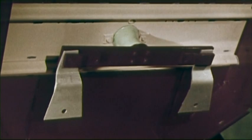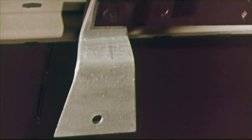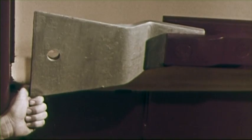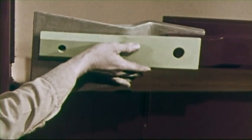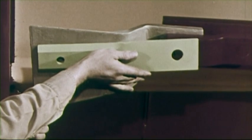The cutter blades that do all the damage to that heavy brush are full cleaver shape. They weigh 20 pounds apiece. They're made of special alloy steel, heat-treated to last. Even their shape is the result of careful design. When a rotor arm is whirling, centrifugal force throws the blades out from the arm. A regular blade would now have its cutting edge on a line with the rotor arm, like this. But the resistance of the material against the blade causes the blade to assume about this position.